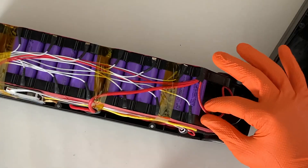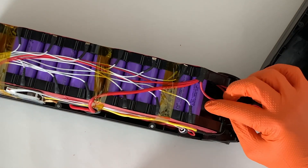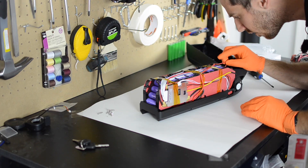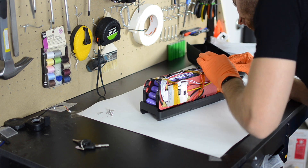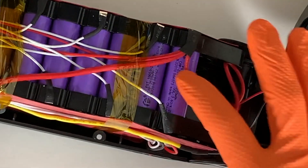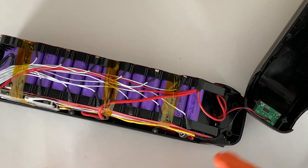Now there are a number of things we can see once we have this opened up. First let's check out what kind of cells we're working with. They said these are domestic cells, so I won't be surprised that these are not one of the big five — either Sony, Samsung, Sanyo, Panasonic, or LG. I see FST 18650, so these are your basic generic Chinese cells — they even say made in China. These are not going to be your best quality cells. I always prefer using Samsung, Sanyo, Sony, Panasonic, or LG cells. You can also easily look up the date codes on those to see how old they are and what production batch they were from.